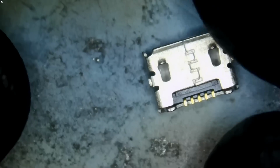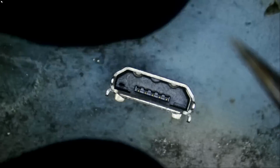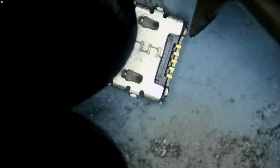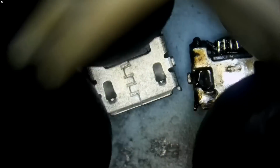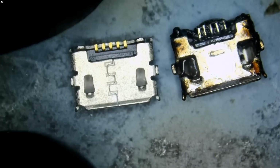All right, so let's take a look. I grabbed number 29 and it looks something like this. You see how we have straight on the bottom, curved on the top. 2 pins in the center, but we also have 2 pins on the back. So we're gonna have to cut the pins on the back. But before we do so, let me just compare it with the customer's connector. The connector looks the same as far as dimensions go. The leg is a little bit shorter, but that's okay.